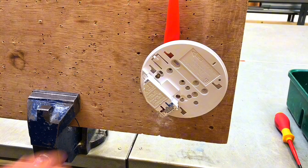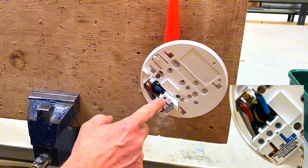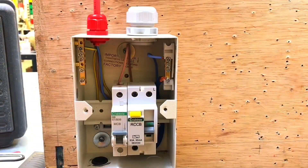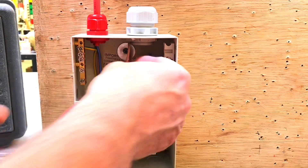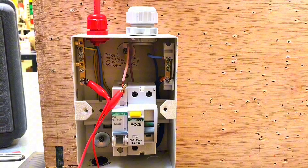I next need to remove the front plate here in order to expose my line, my neutral, and my circuit protective conductor in order to start the test. In previous presentations, I've used my crocodile clip and link in order to link together my disconnected line conductor to my earth bar where my CPCs are connected, in order to carry out my continuity of CPC and polarity test.